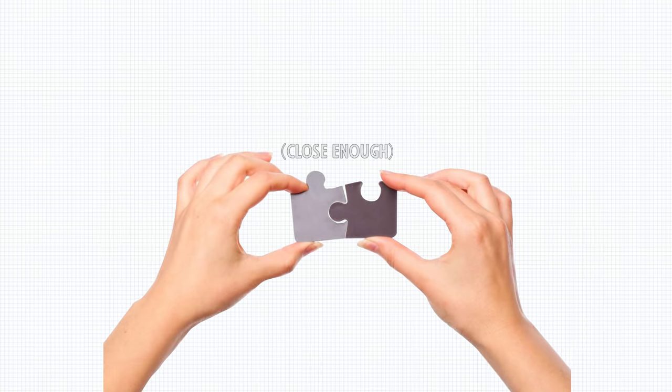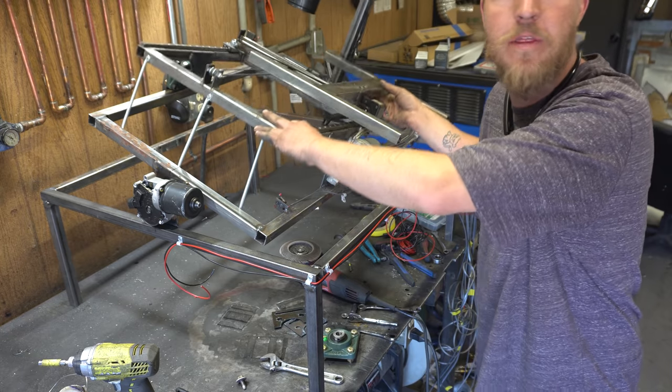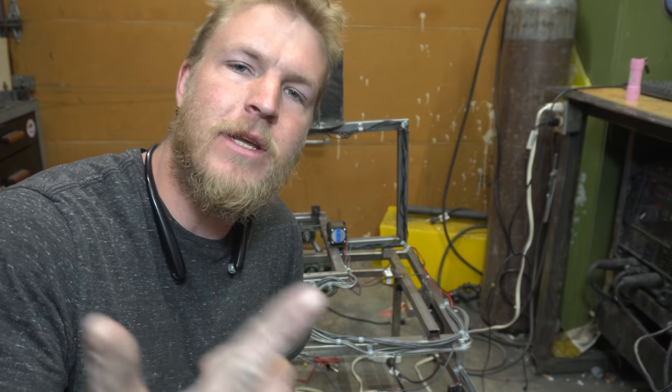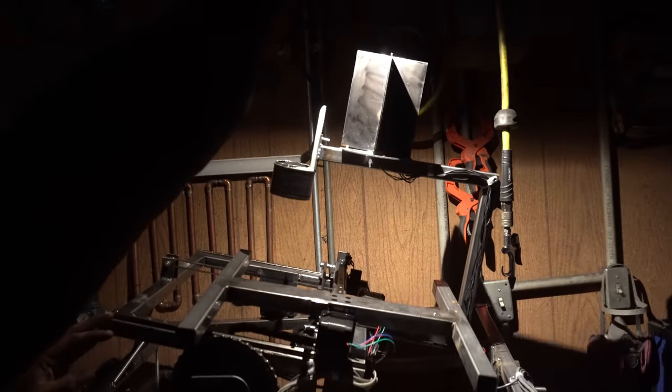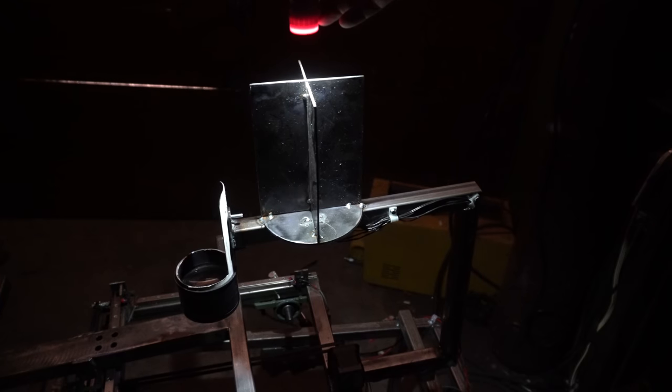This machine is going to consist of two parts: one being the solar tracker, the other being the CNC machine. We got problems — these little wiper motors don't have enough power to move this whole heavy thing around. I printed out these little sprocket gears on the plasma cutter and tried using a gear ratio, but the sprockets were too jerky. So I went ahead and replaced them with lead screws. As you can see, it follows the light wherever that is. It's a little bit wobbly — I used self-centering pillow block bearings which wobble a little. I'm sick of tweaking this thing; it's good enough, and it's going to be moving so slow I'm not even going to notice. It's pretty slow, but so is the sun.